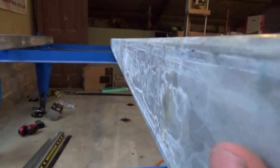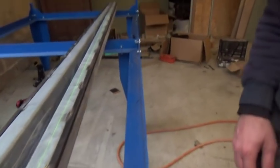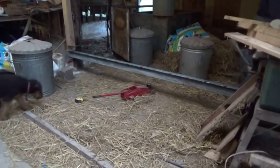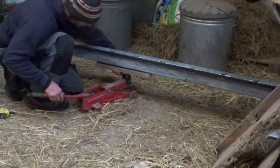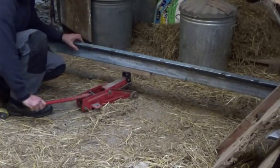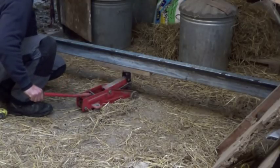Unfortunately at this point we realised we had a problem with one of the rails. By the time the long length of box iron had got to us, on the back of a little lorry on our bumpy Irish roads, it was no longer straight — which is kind of a big deal really. There was three to four millimetres of deviation — that's shocking, too much. I should have cut it up in the supplier's yard and brought it back in two pieces, but I didn't, and now it's slightly banana-shaped. We fixed the ends and jacked up the middle, but the ends kept slipping up the posts and it took a lot of pressure to bend the tube. Believe it or not it took us an hour and a half to straighten this. We had to go slowly for fear of bending it too far.